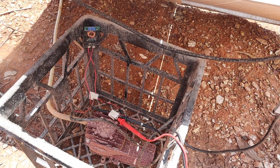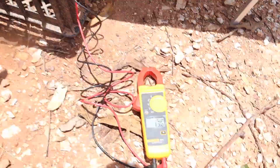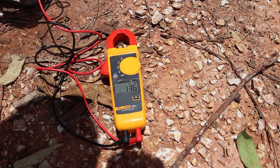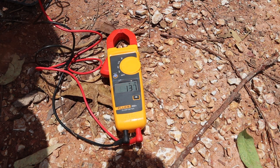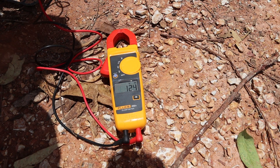I've got the probes of the multimeter into the output socket of the boost converter. The multimeter is sitting at about 13.6 to 13.7 volts. I'll just twist the potentiometer with the screwdriver and you should be able to see it changing. There you go — you can see it going down, down, down as I'm twisting the little knob.